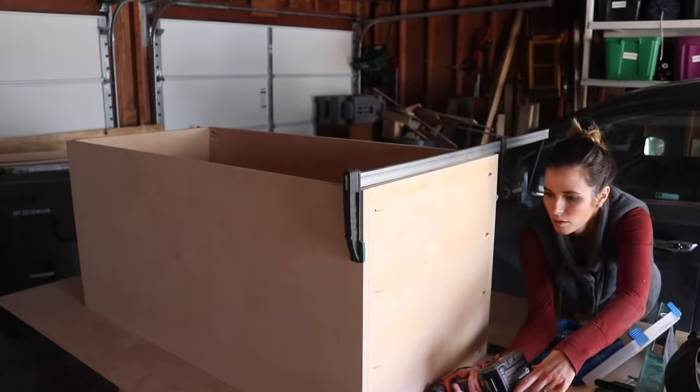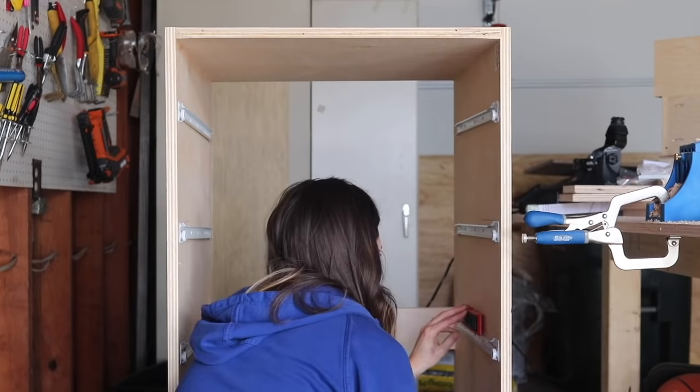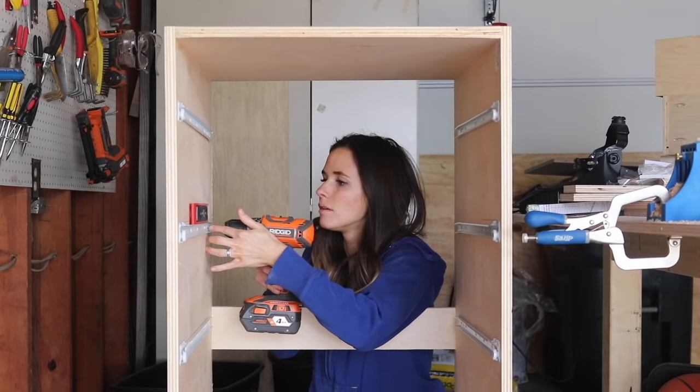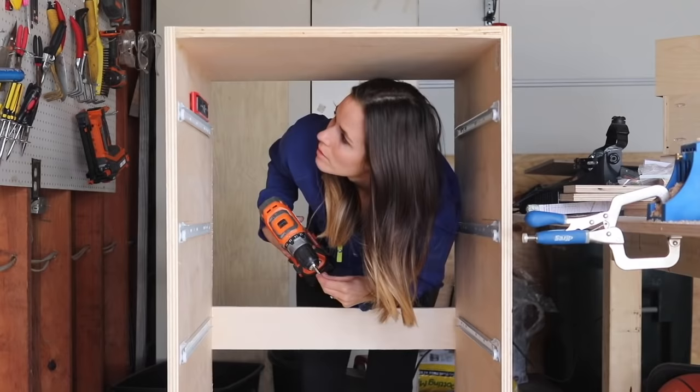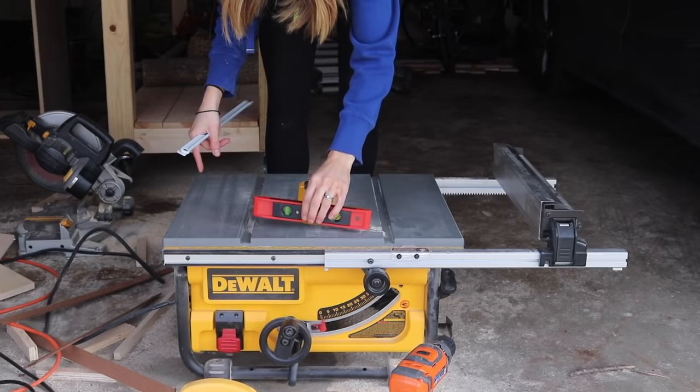During construction I did add another piece of plywood across the back to stabilize the box. I removed this later because each drawer I built is going to be the entire depth of the box. Now I'm installing drawer slides — for the outside part I had to tip the box up so that my level would work and I could check that I was installing each one level. Whenever you're working with something like this, it's so important that you check the level of the ground and your workspace. Everything has to be level before you put it together.